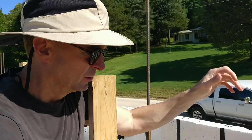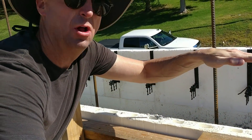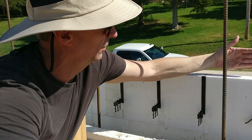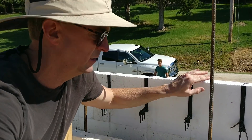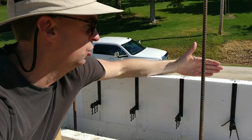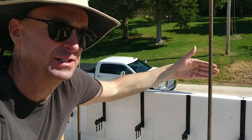The light deck is going to sit right here. It'll be 10 inches tall, and then on top of the light deck is another four inches of topping. We want to make sure the concrete comes all the way out here, so we'll put this form up — it comes up 10 inches, it's a half block, and that'll keep the concrete from pushing out. Then for the four-inch topping slab we'll put a two-by-twelve on the outside, so the finished concrete will be out at the edge.